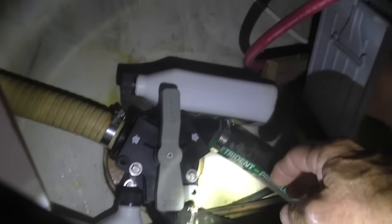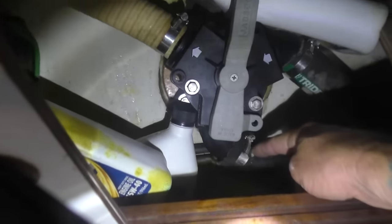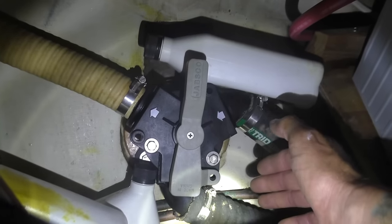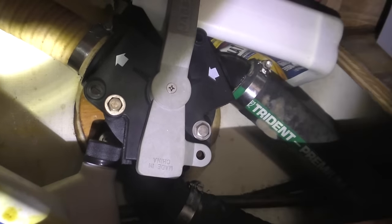So another head job — light in here — and that is a Y valve. I don't have these on my boat. This is the line from the toilet; when you pump it, this selects whether it goes overboard or back down this hose into a tank where you can hold it. So if you're in a marina you would normally hold it. We have overboard right now, which is typical. The Coast Guard really flips out if you have that valve in the wrong position.